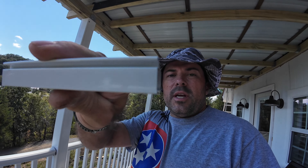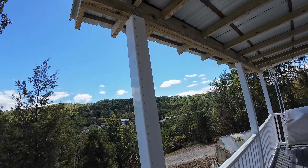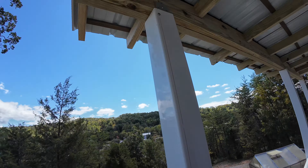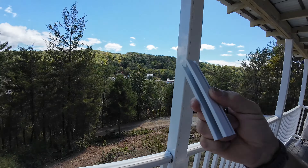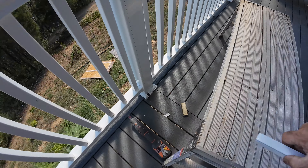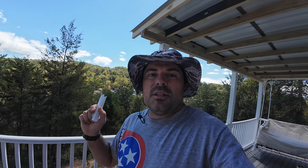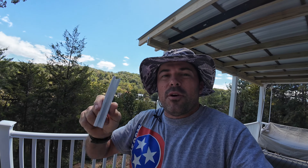I'm working on this screen tight mini track and it's going to go on here. I've made a line down the center so I can put the screws in - the screws hold this track into place. I'm pre-drilling everything and I've notched out my trim down the bottom with the oscillating saw. Now I'm going to put these screws in. You can see by this scrap that I've already cut my piece of track to length.